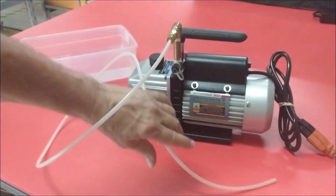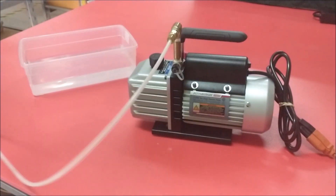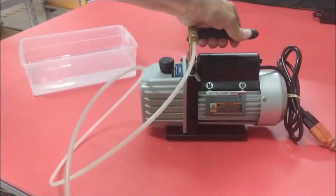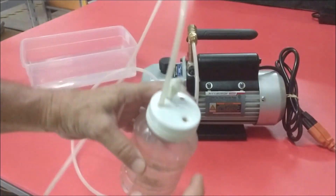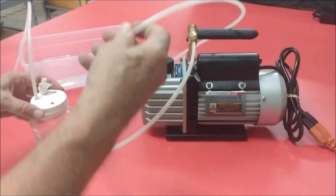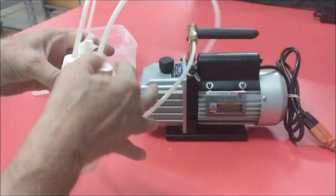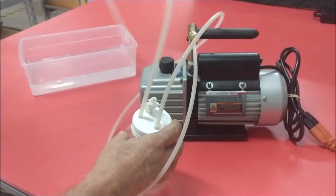You do not want to take directly from the vacuum pump into your liquid, or it's going to suck the liquid into the pump and into the oil, and you're going to have problems. If you want to use your vacuum pump as a siphon, you're going to need a secondary vessel — you're going to need a jar, a jar with a couple of holes in the top. Take your main line from your pump and stick it into one of the holes in the top of the jar. Make sure it doesn't go too far in — you want it to just barely superficial, nice fit. Second line coming out of the top of the jar goes into the liquid.